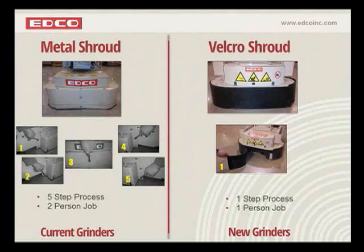Again, two more questions about accessories. One asking if the different bonds and matrices will be the same on the new grinder. Yes. We have the same Dynaserts, it's a new holding case. And then a question about the holding cases in general. If I understand it correctly, they're asking if the Dynaserts and the PCD serts go in the same cases as they do now with the wedge. Yes, absolutely. The same case. It's basically the same case, but it's manufactured with that trapezoid holder on the back. And yes, the PCDs and the Dynaserts go in the same case.